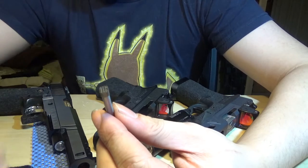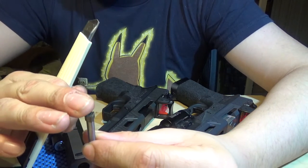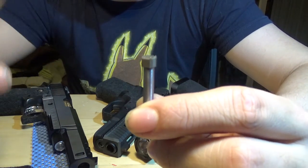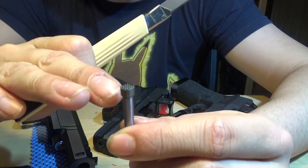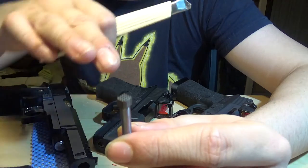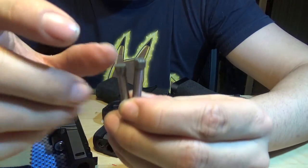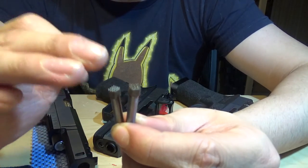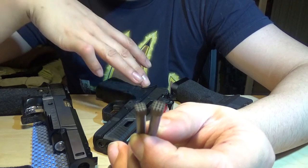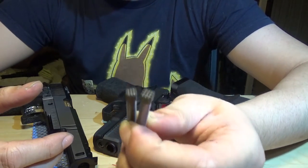And as for the third problem, the structure is actually too short. If it's too short, it'll make the cleaning process even more difficult, because it's a very, very short structure. It will also mean that your stippling pattern won't penetrate into the plastic as deep. So in my case, I actually purposely made these tools extra tall in the pyramid structures, so that it will penetrate deeper into the plastic and make a much more consistent pattern compared to other tools in the market.